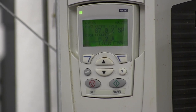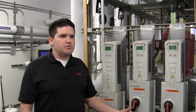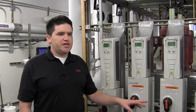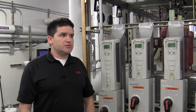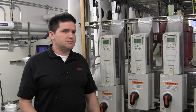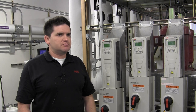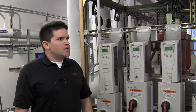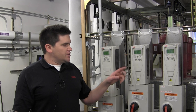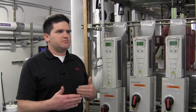Because these are running on Automated Logic, they're going to do whatever Automated Logic tells them to do during a power outage. But the default is to come back to the state they were in before the outage, so if you have a bunch on default they'll all come back on at the same time — be careful of that. Because these are running on Automated Logic control, there's presumably a sequence for that. There's also a parameter for automatic reset that waits a random amount of time before starting so they don't all come on at once.